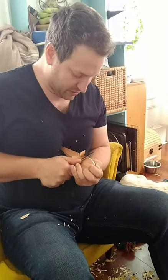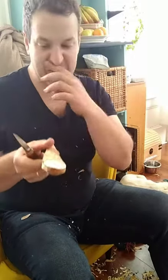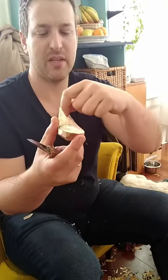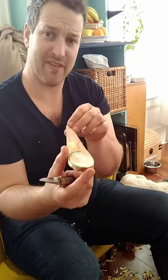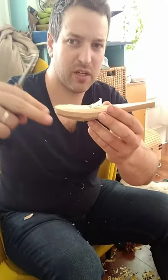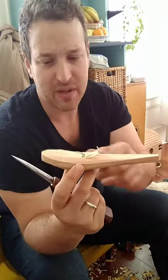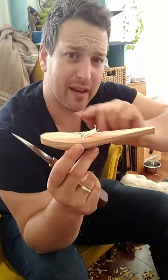And that's particularly important in this style spoon, where otherwise all that material on the side would get in the way. So there's a couple different ways you could handle it. You could allow this side of the top of the handle to be sloped down or not. I find it just flows better if I allow it to be sloped down. But whether you have it meet in a center spine or whether you keep this center nice and flat and you just pull this up in a facet on the side, that's just a matter of what you want to do. But at any rate, having a nice gentle curve that meets its lowest point right here at the very back of the bowl means that the bowl of your spoon itself is basically flat with a very gentle catenary to it.